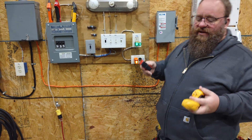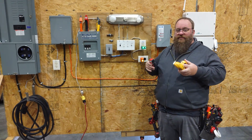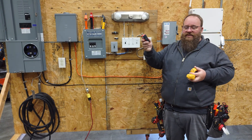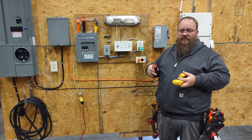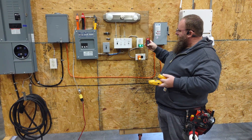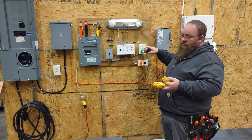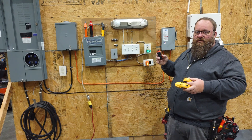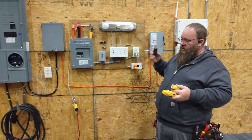If you have mixed and matched versions — say you lose the plug-in tester and you have a couple laying around — they all seem to work with either unit. You can plug one in and use any of the modules or receivers, or take a receiver and pair it with a different sending unit. They also all have a cheat sheet that tells you whether the plug is wired properly or miswired — reversed neutral, no neutral, reversed hot, and so on. They do not check for a hot with no neutral; that's where you start running into problems. That's what the digital ones with a little screen do.